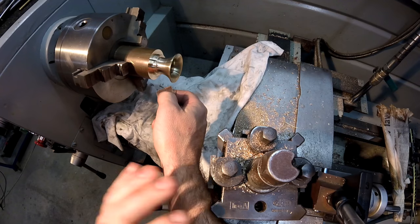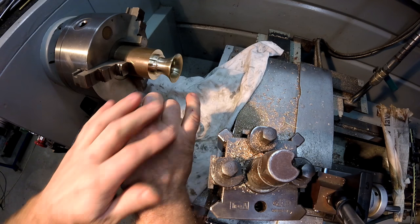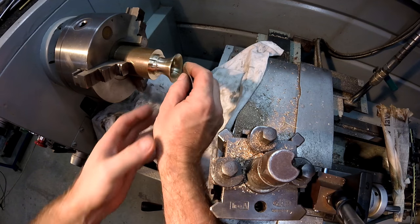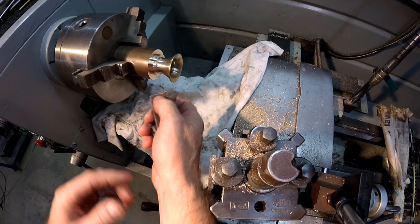and you use the tool post on the back of your arm, and the chances of actually hurting yourself, I mean, I've had some horrendous injuries over the years, I'm talking years ago, and I worked out since I started putting my hand or my arm against a tool post like this to do any polishing work, I've never been hurt since, so I highly recommend it.